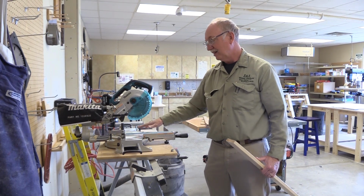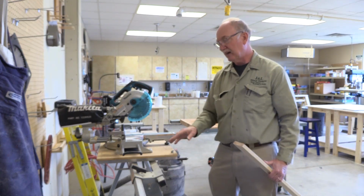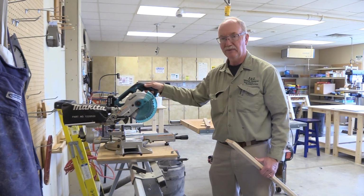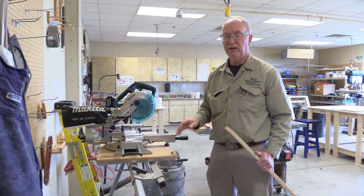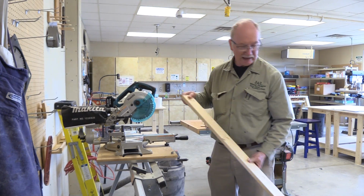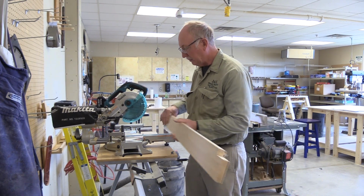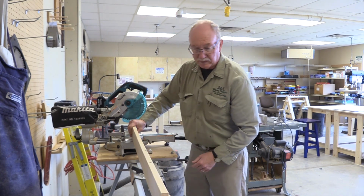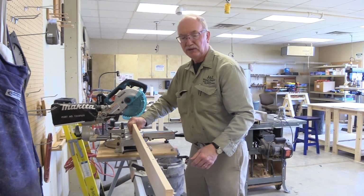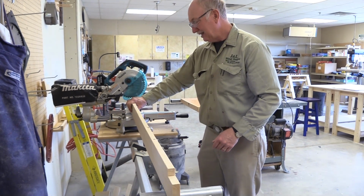That way you can use both your hands to hold the cutting tool or hold the stock. In this case, the saw and the stand are supporting the stock, and I'm using my other hand to cut it. And then I'll hold it up against the fence. So everything is very, very secure. You always want to be secure when you're doing this kind of thing. So then the other thing to line this up, you push this all the way back, and you can do this ahead of time. So the support should be, see how it's actually coming down about an 1/8 inch?